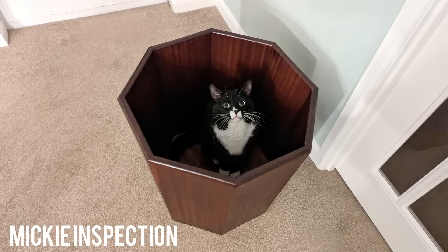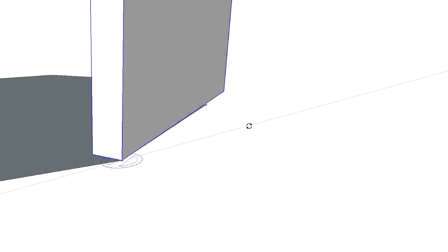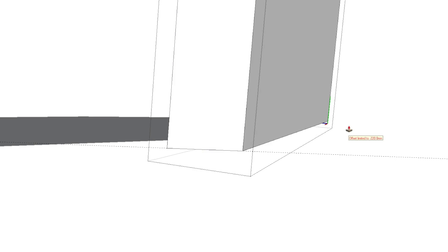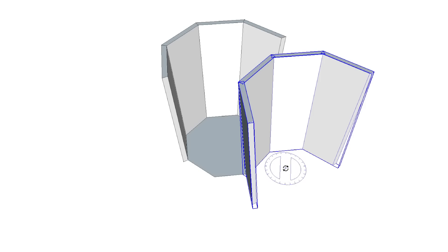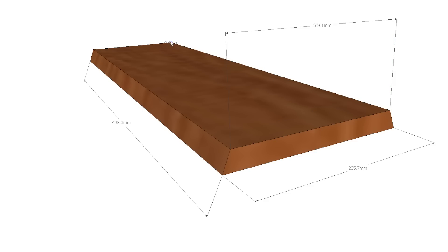I mentioned earlier showing you where these dimensions came from. Using a piece of software called SketchUp I did a drawing starting with an octagon for the bottom panel the size that I wanted it to be, then drawing the sapele board dimensions. I rotated that by 85 degrees, aligned and centred it with one of the octagon edges, then marked up the 5 degree angle at the bottom using the protractor tool to give me a flat bottom. I figured out how high I wanted the basket to be and again marked up the 5 degree angle at the top and deleted the remaining part. I can then copy that component onto the next edge of the octagon, draw a line to split the boards where the two boards intersect at both top and bottom, delete what's remaining, and repeat on the next side. With that component complete I simply copy it onto each edge of the octagon to give me all eight faces. With the model complete I use the dimension tool to measure up each edge and that's it all figured out.